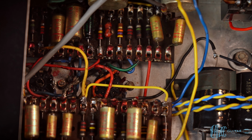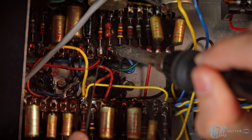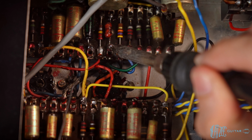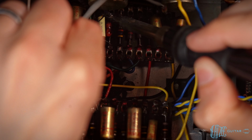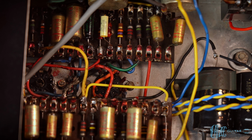So alrighty, let's fire up the soldering iron and get this done. Now this still has its QC paint on it, which means it's gonna be difficult to get the solder flowing. So we're gonna add some solder on this side. Perfect. We got our little piggyback capacitor there, and we're good to go. We can see clearly it's 0.022, so it's very obvious. You can see the 500 picofarad under that. Brilliant. Stoked. All right, let's go ahead and get this inside and do some recording.